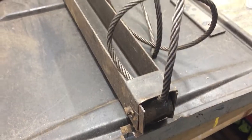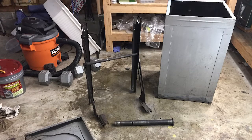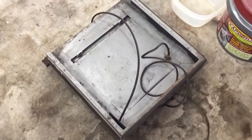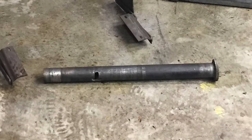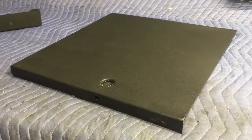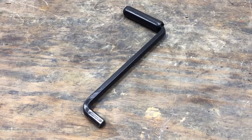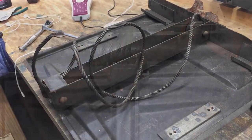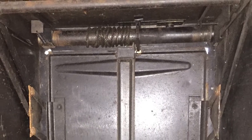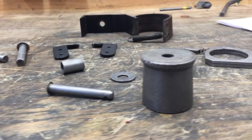Additionally, with restoring the stand, I got to figure out how it actually works. The Jack-in-the-box stand consists of the base, a platform that sits inside of the base, a steel spool, an inner frame with arms that attach to the platform, a cover plate, a locking bar, a crank handle, and a steel cable that helps raise or lower the platform inside of the stand. There are also a few other parts that help make this stand work.